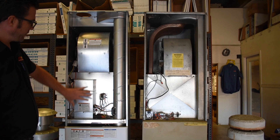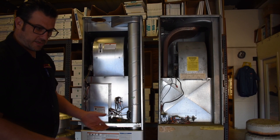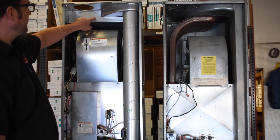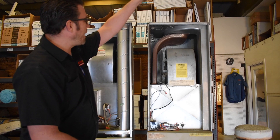The overall design of these two furnaces is very similar. Both have the controls in the same corner, a blower motor that moves air through the ductwork into the floor of the home where heat or air conditioning comes up. There's also a combustion air inlet tube and a flue where spent combustion gases leave the furnace through the top — basically the same setup on both units.